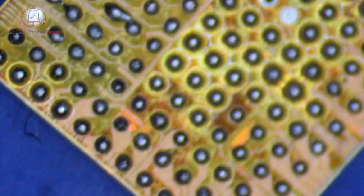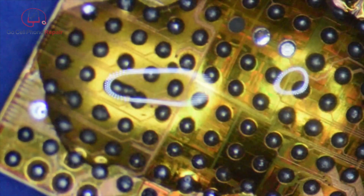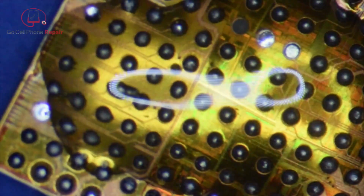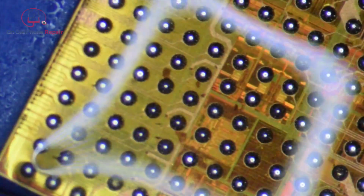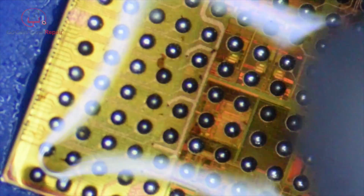And meanwhile, we're going to clean up this chip. So we will put some flux down and get a soldering iron and just kind of go over this very lightly. We don't want to spend a lot of time with heat on this, obviously, but we want to get these pads somewhat evened out. And again, hopefully remove any oxidation that's on the surface so that when we apply the new solder, it will stick and we won't have any problems with this developing over time. And once you get this so that it's looking decent, we'll go ahead and wipe it down with a swab.